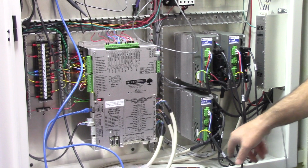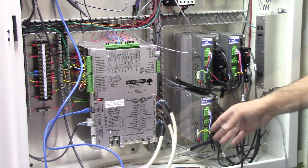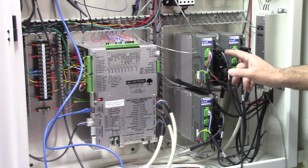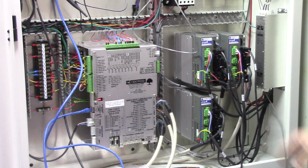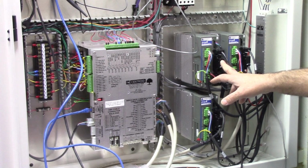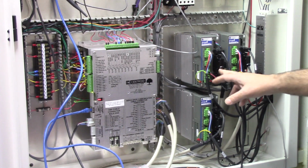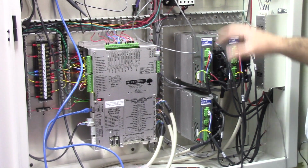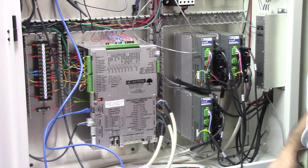And then these were provided by DMM Technologies. They use Centroid's data cables, and then they terminate it for you, and that's the best way to go, is let them do it. Now, there were several revisions of this, and I think I got these, boy, it's got to be the last half of 2019, the last quarter of 2019. So if you're a Centroid Oak user and your drives and cables were purchased somewhere before then, you might want to check with DMM to make sure you got the latest and greatest.